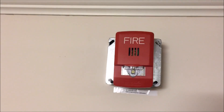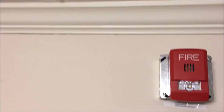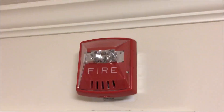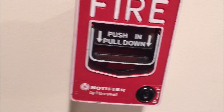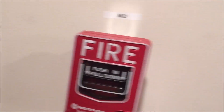The first notification appliance is the Wheelock LHSR LED horn strobe, set at code 3 and 75 candela. Coming over here, we have the Wheelock HSR Exceeder, set at code 3 mechanical horn, 30 candela. We're not going to talk about that one — that comes later. Coming down here is the Notifier NBG-12L dual action conventional push-pull and lock pull station.